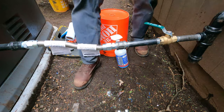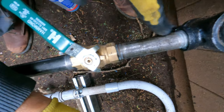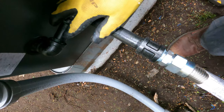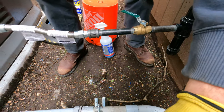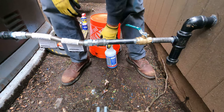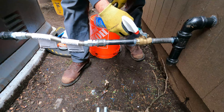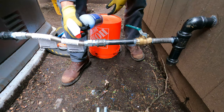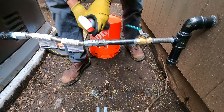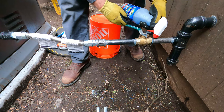Let's spray it up first — this way it'll be bubbling when I get back out here, making it easier to wipe the dope. Gas is on. I usually want this as a liquid with no bubbles in it because it makes it harder to tell when it leaks — it's going to foam up. I cleaned up these fittings and took most of the excess dope off — I don't want a lot of excess. I'm even going to clean it out of the threads because it's hard to paint over dope.